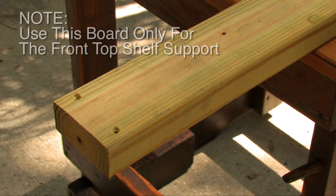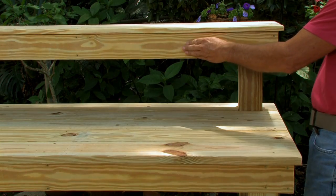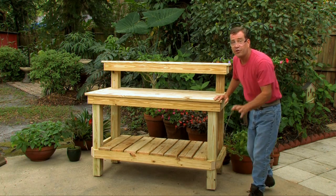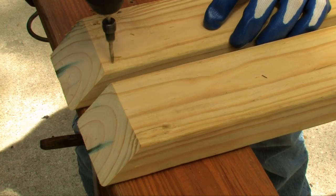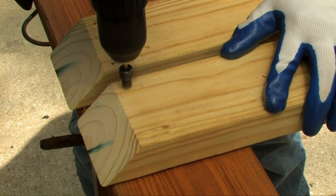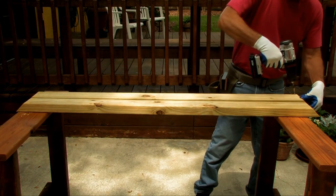The one 58-inch two-by-four that has only two holes per side and center is the top front support for the top shelf — set that aside for now. Next, pre-drill the bottom shelf boards all the way around — the ones with the 45-degree cuts. Pre-drill right where the 45-degree angle ends, on both the long pieces and the short side pieces.